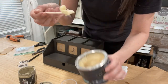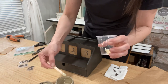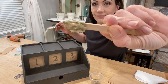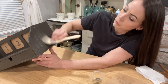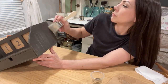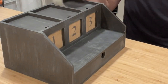Here's a fun little trick you may not know: you can take DIY clear wax and a little bit of any color paint and make your own colored waxes. It will change the formula of the wax just a little bit, but the color is so pigmented you don't need much paint and you still have a really beautiful wax — just make sure you give it plenty of time to dry. So I mixed up a little Sandy Blonde with the clear wax and I'm using a chip brush to give a weathered finish to this weathered wood look. I could have used white wax but I didn't want such a stark contrast between the brown paper and the white wax, so that Sandy Blonde was just perfect.